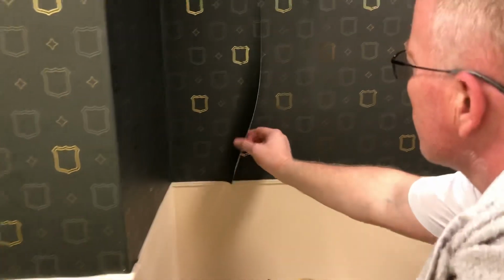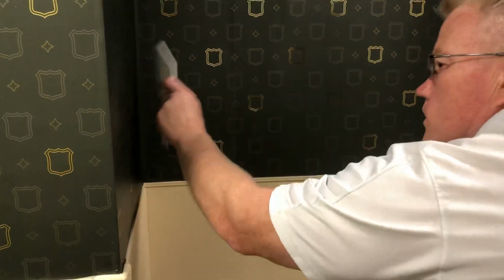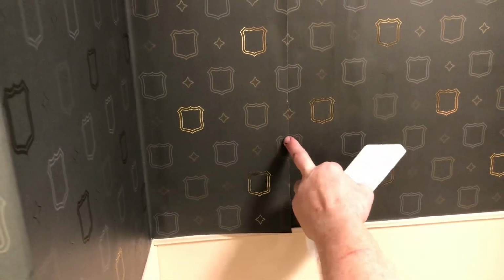And so we overlapped it. You see, my corner has affected the seam. Look, see this corner, bring them in here. I want you to get that action here. When I worked this corner, it pulled away an eighth of an inch. Now, if I pull it back, I'm going to mess up my corner, right?